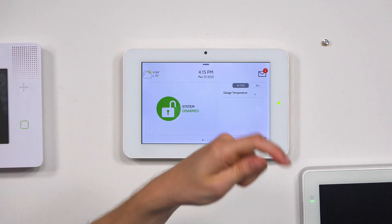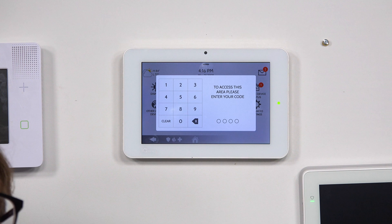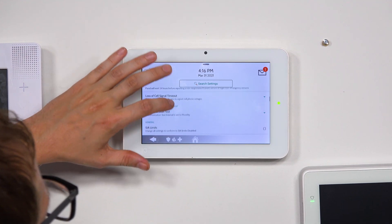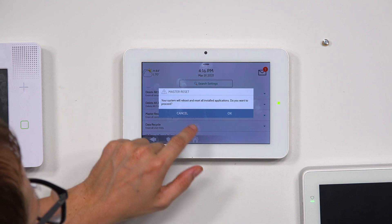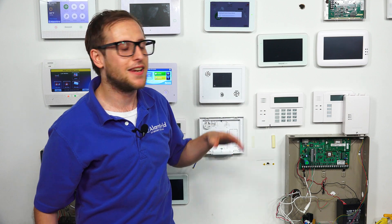So what we're going to do, we're going to start from the main screen of our IQ Panel 2 Plus. We're going to hit the small gray bar at the top, choose Settings, then Advanced Settings. And then we're not going to use our master code or our installer code. We're going to use our dealer code, which is the highest authority code on the IQ Panel 2 Plus, and that default code is 2222. And then we're going to choose Installation and then Dealer Settings. And then we're going to scroll down quite a ways and we're going to see Master Reset — Erase All Content and Settings and Restore to Factory Defaults — and we're going to hit that. And it's going to reboot and reset all installed applications. And now our IQ Panel 2 Plus is going to do its factory reset. That's going to take a few minutes. But that is how you would factory default the IQ2 Plus. A different panel is going to have a different factory resetting process, so refer to the manual for your system if you want to do a factory default.